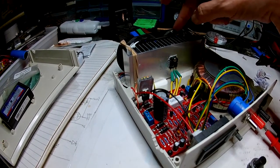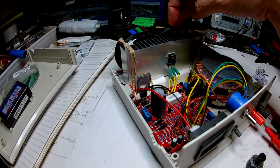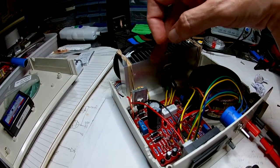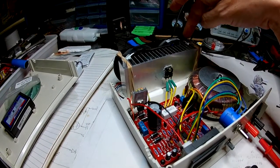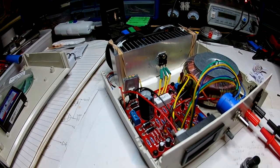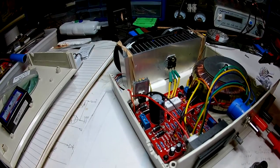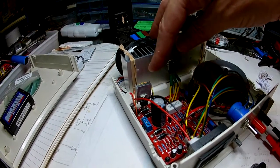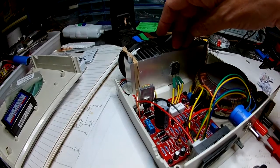I've got a couple of fans here - I can't remember where I got them from, some server power supply I think. I used the same adhesive gunk you use for putting capacitors in to hold them down to the bottom of the case - it works quite well, I could pick it up and shake it and they don't come out. These elastic bands aren't really needed now because they're gunked to the edge, but I'll leave them on anyway. I've also put a 220-ohm 5-watt resistor there - with the 2-watt one it was getting quite warm but the 5-watt one hardly gets warm at all. The two fans are wired in series off the 24-volt, so they don't blow too fast or loud but fast enough to keep it cooler.